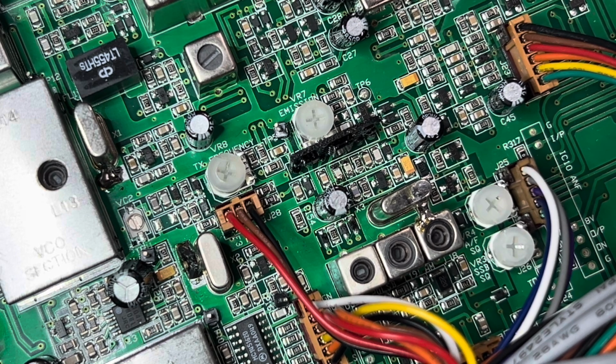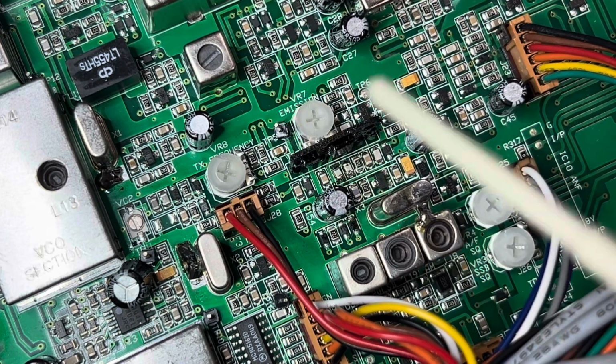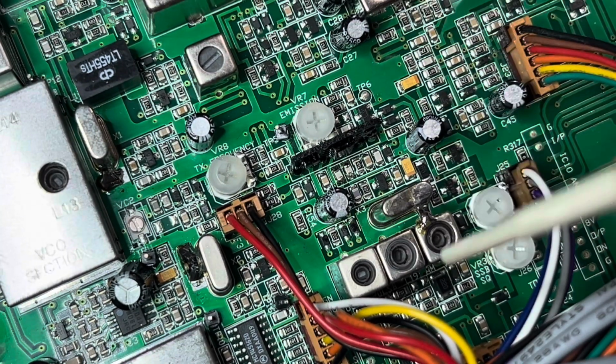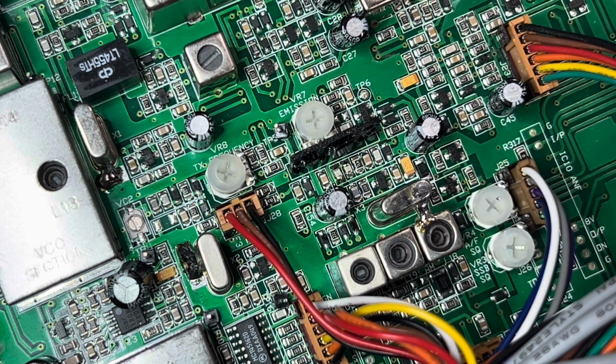you can hurt yourself in here. This is high voltage electric in here. Don't go screwing around. No metal tools, plastic tools only, all right? What did I say about your hand? One hand on the bench or in your pocket. The other hand's hovering. You're not resting on the metal, nothing. You're hovering. Slow, slow, slow.